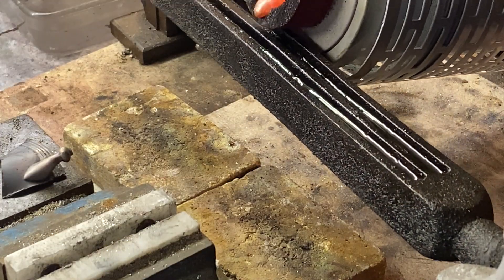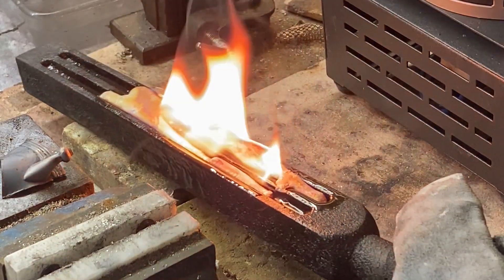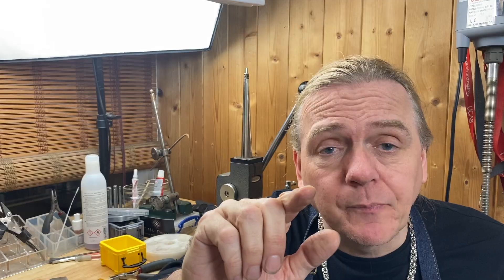Just a little point on safety advice here, guys. Obviously the furnace is hot and the metal that you're pouring is going to be hot, so you've just got to be careful about any spills or splashes. It's worth looking up welding safety equipment — for example welders gloves will protect your hands from the heat when you're putting stuff into the furnace. Get yourself a full face shield to prevent any splashes. Very important: a welder's apron. You don't want something like cotton that's flammable — you want something leather that's not going to catch fire.